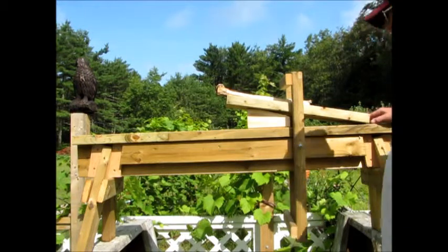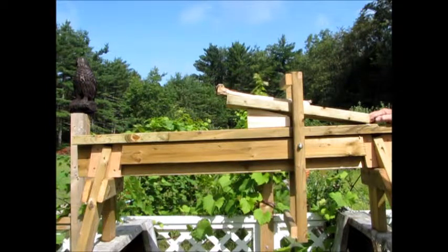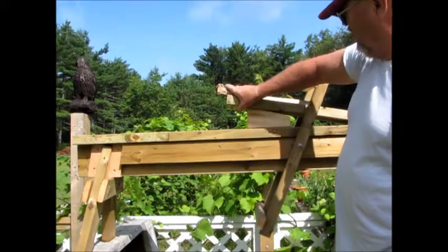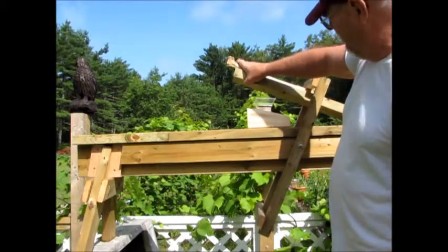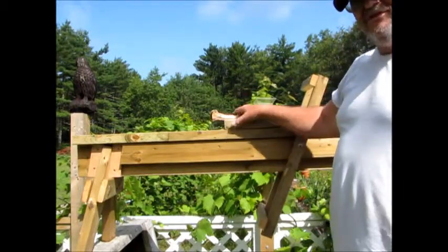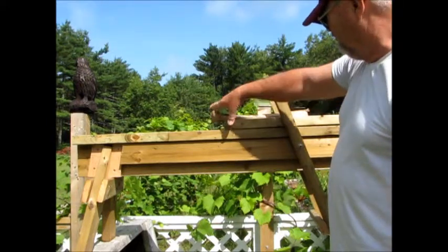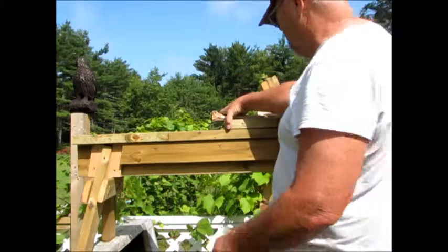As far as a hinge is concerned on the ramp, I just used a standard T-hinge. I did have to route out a little knuckle hole in this top plate for the hinge, but that was no problem. It sits level. If need be, I can sit this way up, or it will lay flat, which helps out with storage. As you recall, that was a very important aspect of the whole thing. So, that's my bodger bench.